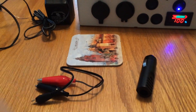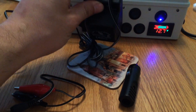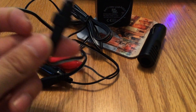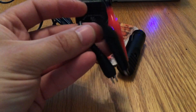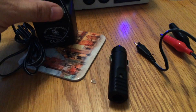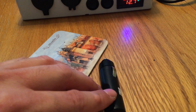I just wanted to do a quick video on an alternative way of charging these bivvy boxes. What I noticed is this charger comes with some crocodile clips and you can either have the 2.1 jack plug or you can just put the croc clips on. So what I was thinking is, get a cigarette plug — what goes into cigarette lighters — and get this end, take these crocodile clips off and solder it into here.